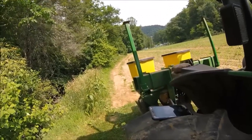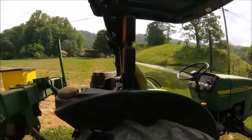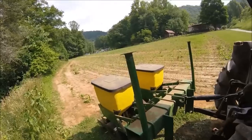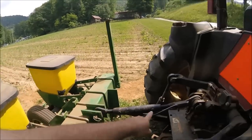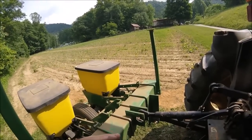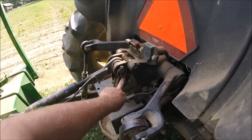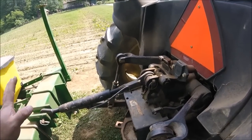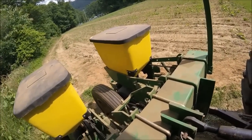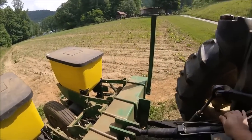When I picked the unit up you could see it tilted the other way. Letting it back down it's pretty level, but it still needs work. To force the back down I need to lengthen the top link. Most tractors have multiple holes for draft control — you can alleviate some of that by moving the pin to another hole so it comes up straighter. It picks up high enough to make a turn, so I'll lengthen the top link.